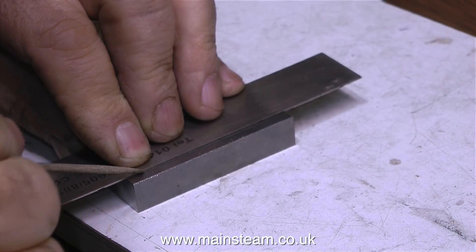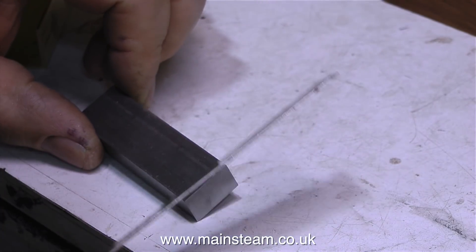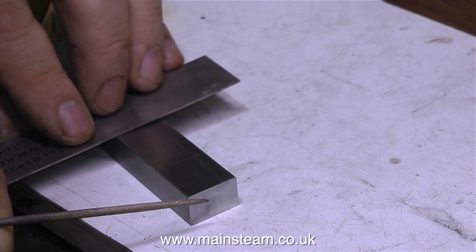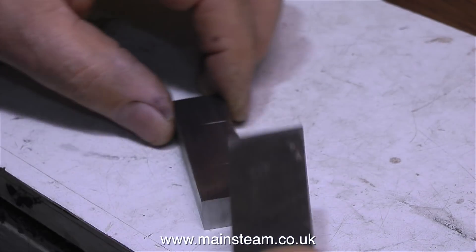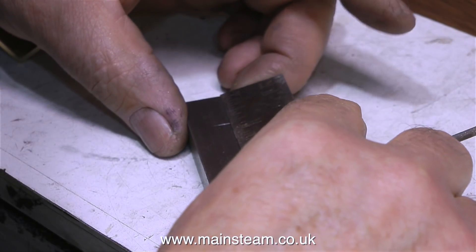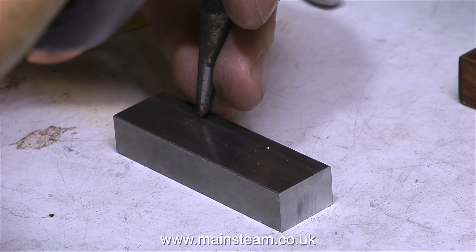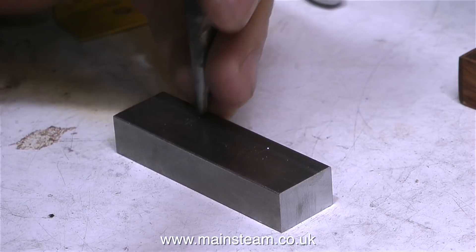In this clip, I'm using a needle file — because I always use a needle file as a scriber — to check that the holes have been transferred in the correct position. The general plan with these steel blocks is to use them to hold the boiler to the baseboard. So when I've drilled and threaded the two holes, I'll need to drill a third hole in each block to allow me to screw them down onto the baseboard. Normally after marking out I'd use a centre drill to spot the positions, but just for a change I'll use a centre punch.